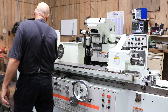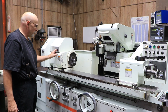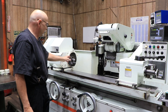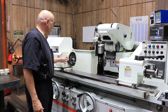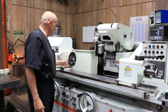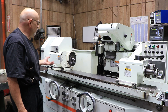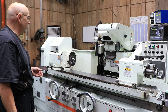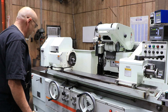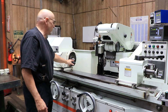Workhead — this workhead can swivel. A couple of screws that you have to loosen and it swivels. You have a jog button. I believe this is a Morse taper number four. This is a live and dead setup. In other words, you can have a faceplate and a chuck on here, or you can grind between centers like it was being used by the previous owner, the way it's set up right now. And then this would be your drive dog.